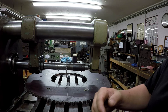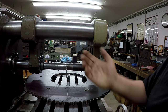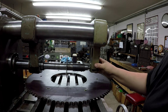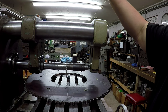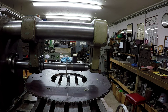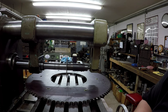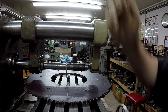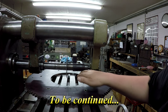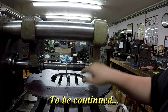All right, we got the stack-up done and I'm getting much better results now - everything is drawn up tight. As you can see we're going to use this support out here on the end of this arbor, so that should make a nice rigid setup. It's not in a bind anymore, running nice and straight. I've got to make sure I got some low clamps on here to clear the arbor - that'll be the next step is getting the clamps set up and then getting the groove lined up.